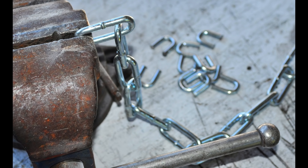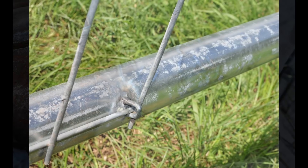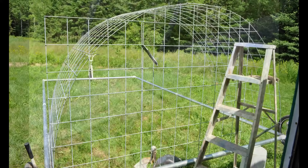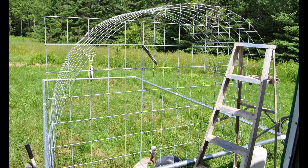I use one-inch chain a lot in the build — not only for the wheel lockout, but to hold the hog panel to the frame. I cut the links in half, weld them to the galvanized tubing, and that's what holds the hog panel. This is a lot easier than welding the hog panel directly to the frame, and because it can move a little, there's less chance of a weld cracking if there's stress on the roof. I also made the end walls from hog panel, tracing around the curve so I knew what size to cut them.